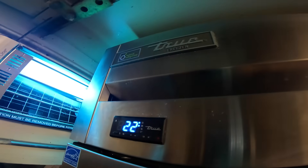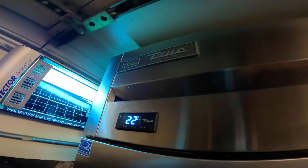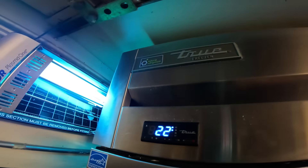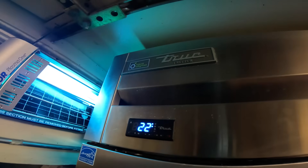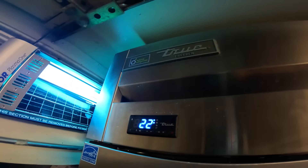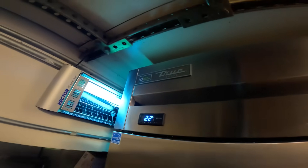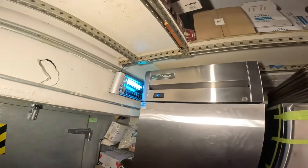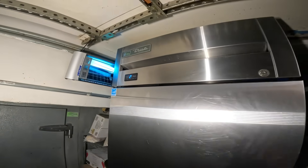Temperature is coming down, taking quite some time — we're just going to let this thing be. Everything is running, so what are you really going to check? The only thing left to consider for efficiency would be if this thing has the correct charge, because all the components are operating and there are no error codes. If it doesn't reach temperature, it could be an issue with charge — and with this type of gas, good luck. We're gonna wrap this one up. If anyone found this video interesting or helpful, please drop a like, comment, and subscribe. Make sure to do your maintenance — I'll catch you all next time.